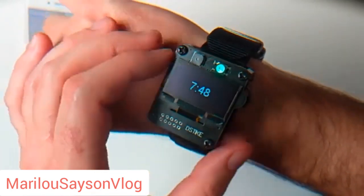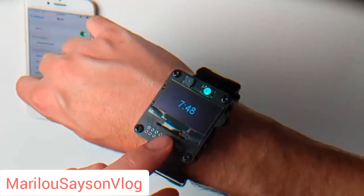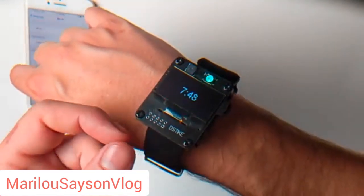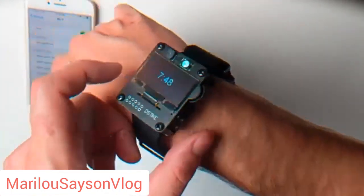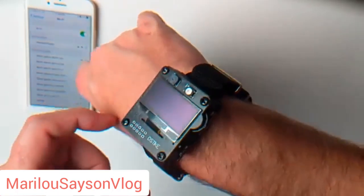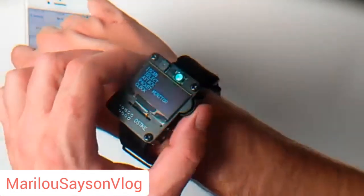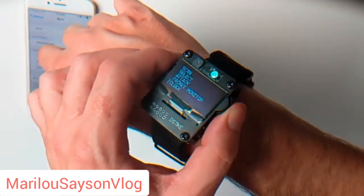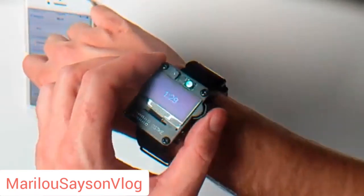There's also a clock here. Something to note is that if you take this apart and look inside, the battery power is actually a small tiny LiPo battery, similar to what you'd put in a very small quadcopter, and there's a power switch. Every time you turn this watch off and back on, the time resets because there's no persistence of power, so you have to set the clock every time you turn the watch on — which is totally worth it for a watch that can deauth things.